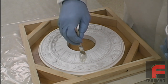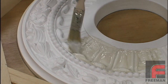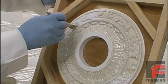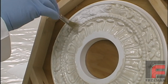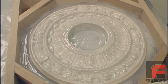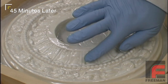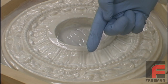We begin applying the 1035T onto our part with a small brush that has been cut to create a pointed end. We are making this layer as thin as possible to minimize air entrapment. One of the advantages of using this material is that it can be applied on a vertical wall — notice how the material doesn't move at all. Here is what the completed first application looks like. After 45 minutes, we test the material to determine if it has reached the almost tack-free stage.